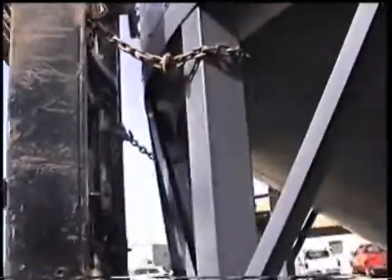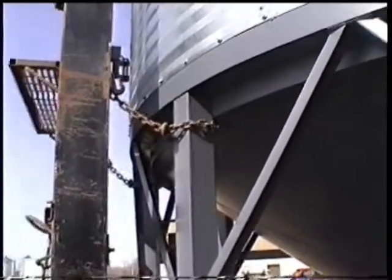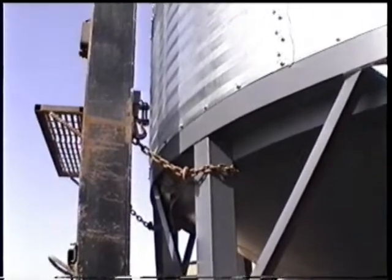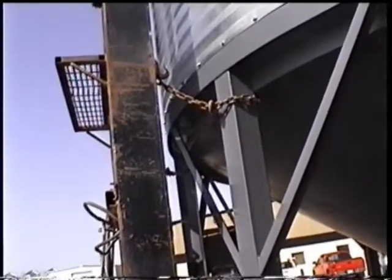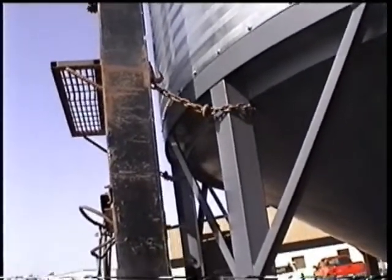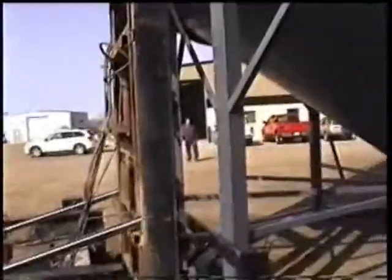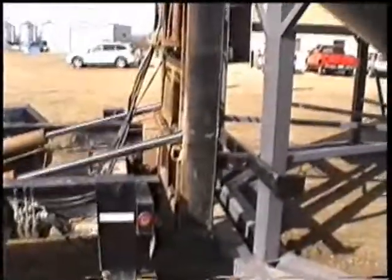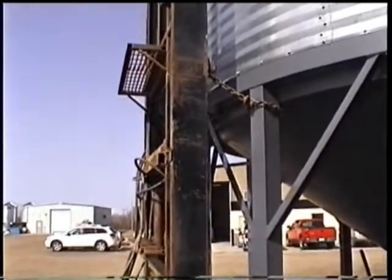Our outriggers will take care of the slack — we can take out a certain amount of slack with the outriggers. We try to get both chains equally tight to maintain continuity so that the bin lifts up evenly. If we cannot get an even pull on the bin, we'll simply set it back down and readjust the chains so they are taut. Sometimes as you lift your outriggers the bin may adjust itself due to pressure on one side, so we set it back down and adjust the loose chains. Now Al is adjusting the outriggers, which is in turn tightening up the chains. With the slack out of the chains, when you start laying it down it's going to lift and lay at the same time rather than just a pulling motion.